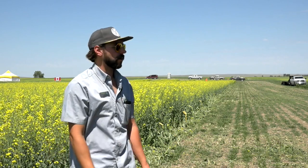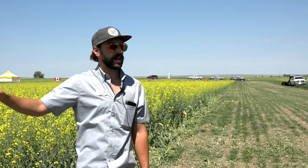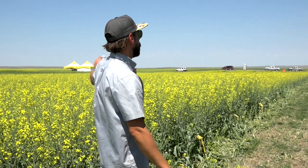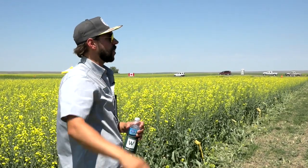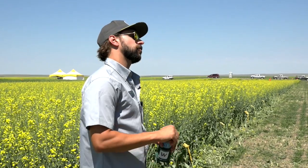Having big plots makes things a little easier for this kind of research. Because of the setup on that system it's hard to just run a serpentine and keep everything randomized, so we ended up seeding both seeders at the exact same time — seeding one rate with the air seeder and one plot with the air drill, doing four plots for each rep, then coming back to base to change sprockets or zero-max settings and start over. We spent basically an entire day seeding this trial, whereas with the mustard we seeded eight or nine trials in less than a day — a lot of extra work went into this side of things.